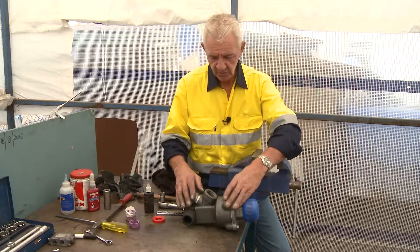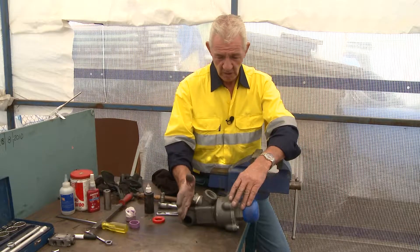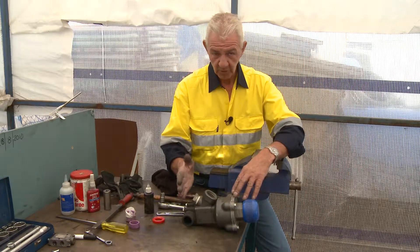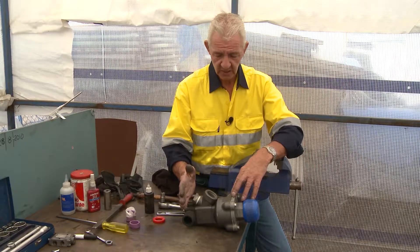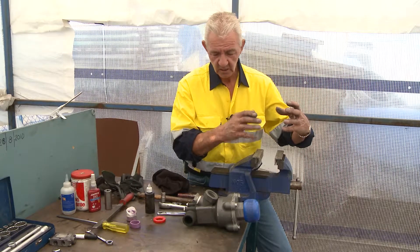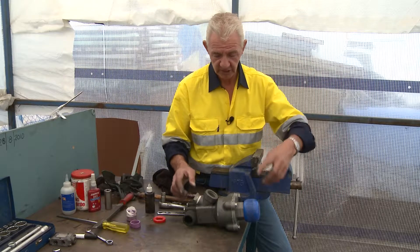The other differentiation you'll get is where the air is held inside the pot and coming down the pusher line, and you put a nozzle on there that has a greater air requirement than what the compressor has the capacity to pressurize the pot and fill your line. If the nozzle is too big or worn significantly, you'll get differentiation of pressure because the draw-off is far greater than what you have in the pressure vessel. So the differentiation is what the pressure vessel is holding versus what's coming through the pusher line versus what's being exhausted — the exhausting side is far greater than the pressure side.